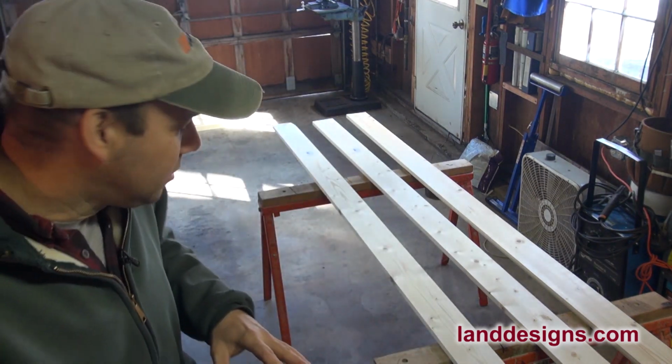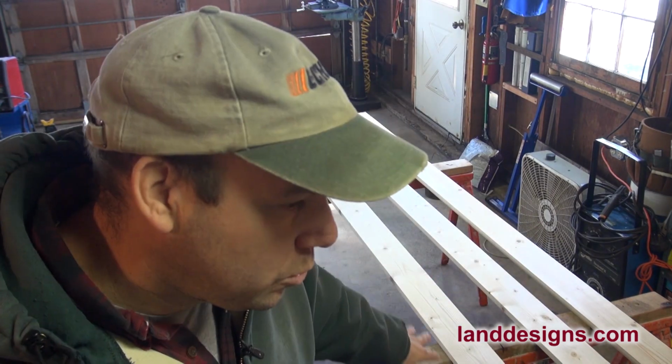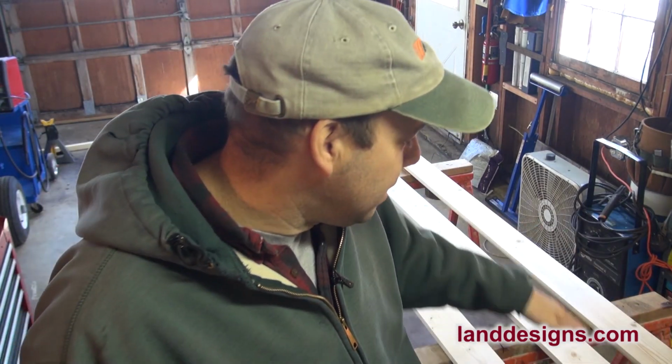But anyways, we're going to take one of these boards and cut it into some L-shaped pieces, which are what we use to mount to the ends of the log. And then we need to make the rail, which is basically going to be a T. One end of that T has to have a 2-inch height to it. And then we can just run those wheels from the timber jig along that T. So I'm just going to go ahead and cut some of these boards into some pieces, and then we'll come back and show you what's going on. I can't say carpentry is one of my stronger suits, so please work with me, and if you see any tips, put them below the video.